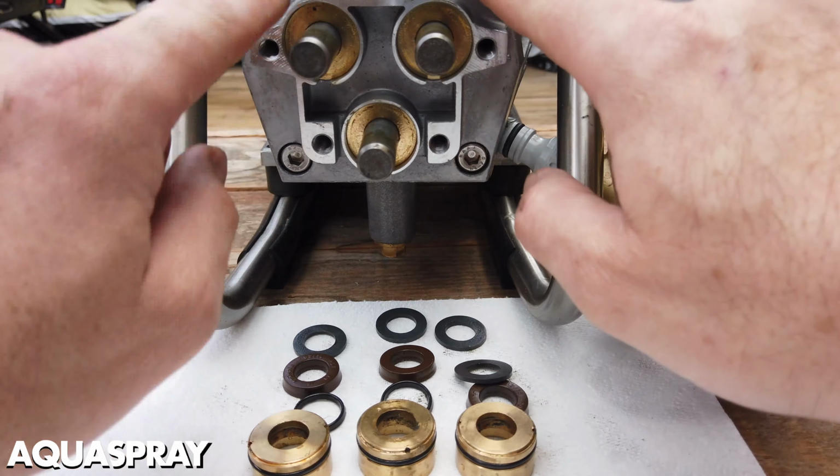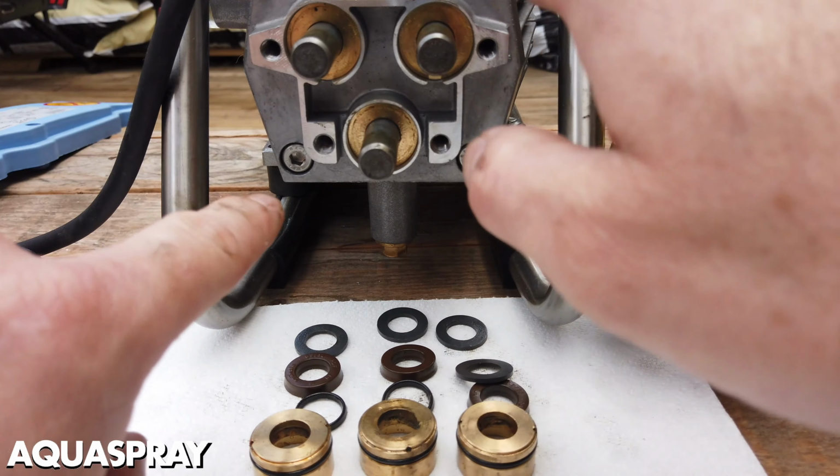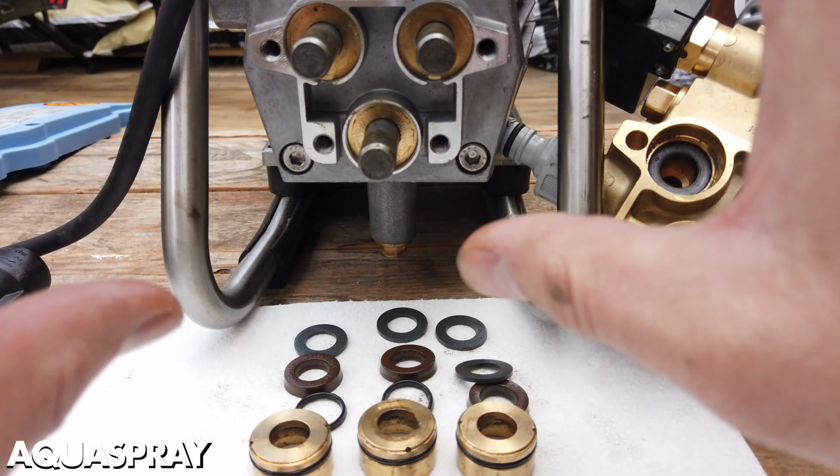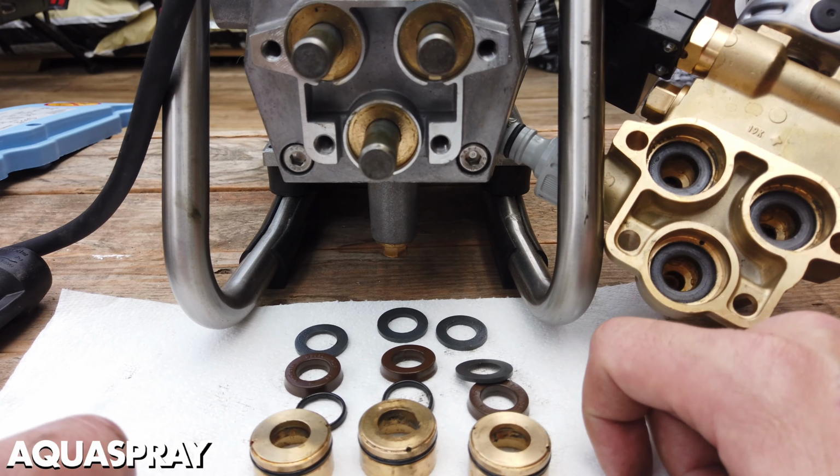Remember, if you do take these bolts off, you've got pistons with quite strong tension springs, so you need to take these off very evenly, like tightening up a car tire, but the opposite way. So just little by little, corner by corner, until it draws off. And when you do take it off, the oil will drop, so make sure you can catch it and dispose of that properly.